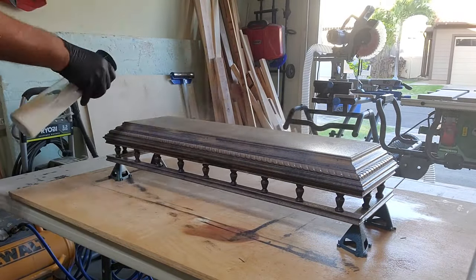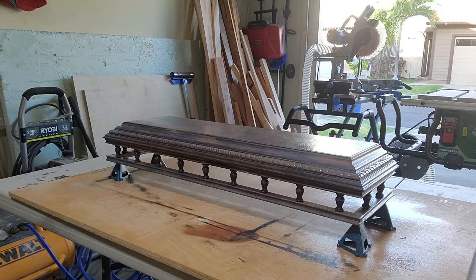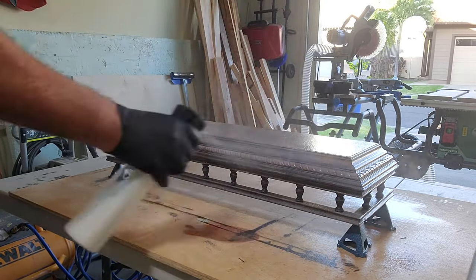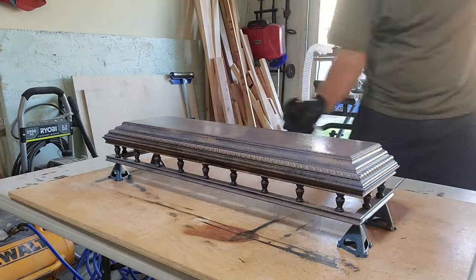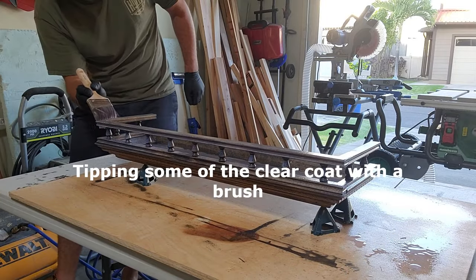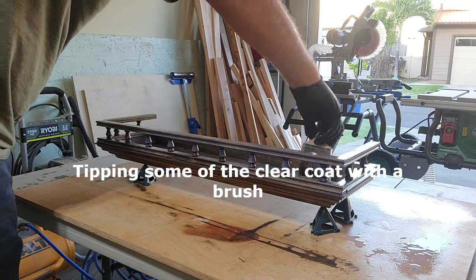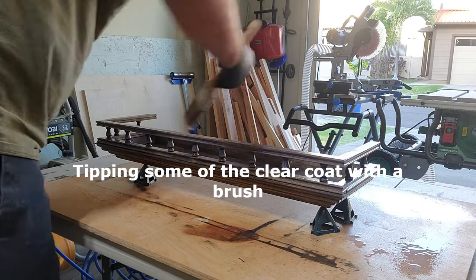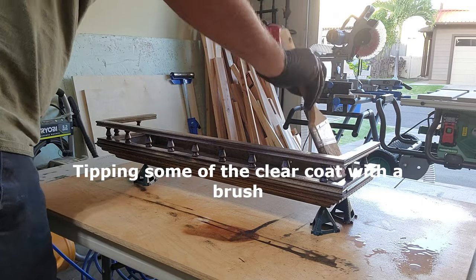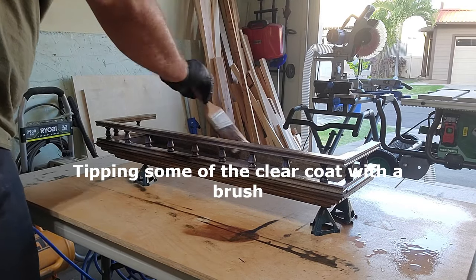To apply the clear coat I'm going to use a continuous spray hair spray bottle - I put out a video with my buddy RJ about that, check it out after this. Just like with the stain, all those nooks and crannies from the trim will get covered when you spray the polyurethane - it gets into all those areas instead of creating bubbles like going over with a brush. The sprayer creates a nice atomization and doesn't have any surging like a normal spray bottle.